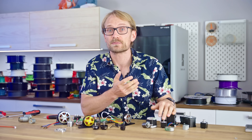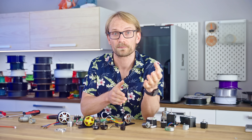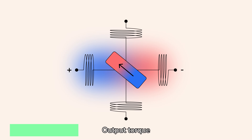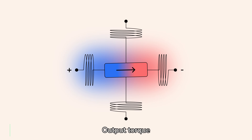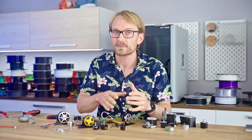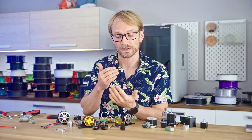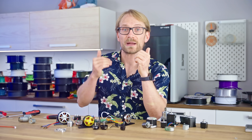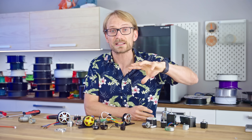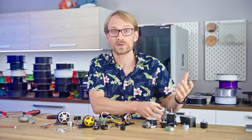This means that a stepper motor will constantly pull the rotor towards the ideal position and sort of lock it there, while a servo relies on the softer control loop to initiate that correction. But steppers aren't infinitely rigid either — they act sort of like a spring and only produce maximum torque just before they lose a step. Softer loops can be tuned to better suit a specific system, at the expense of needing quite a bit more computing power — that's why these have a dedicated ESP32 on them. Theoretically, even with basic stepper motors, 3D printers can make estimates about how much torque they need by looking at how hard they're accelerating or braking and dynamically ramping current up or down. The ability to make predictions and use them for things like input shaping is a major reason why open-loop steppers still work so well for 3D printers.